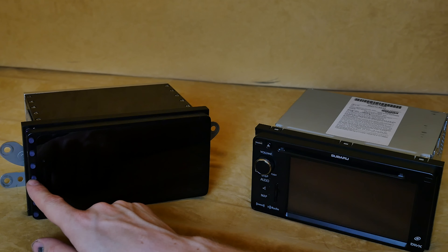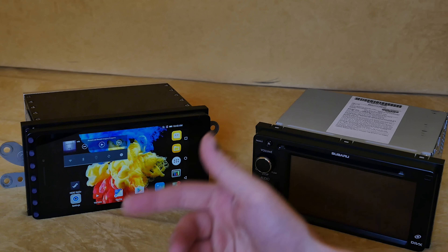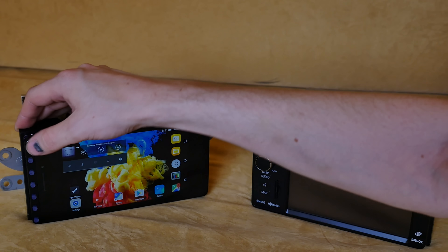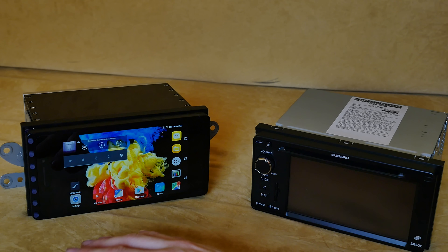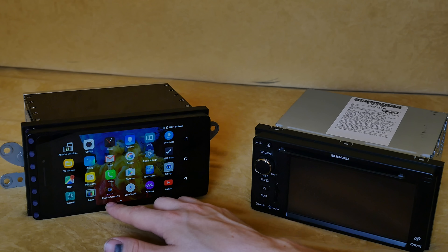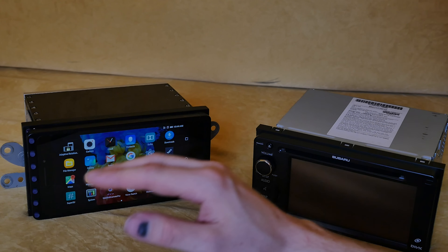I have an ARM Cortex M4 MCU that watches these buttons. If I press: this is play/stop, this is music backward, music forward, this is answer — because this box has Bluetooth — and this is power. Right now, because there's no power connected, only this button works, which is directly connected to the tablet. I have rooted this tablet to get as small a ROM as possible, and not all apps are installed. This will be my backup camera, and this shows other functions.